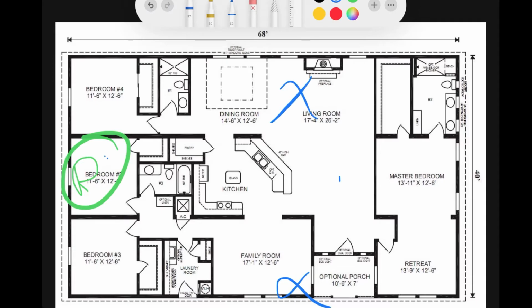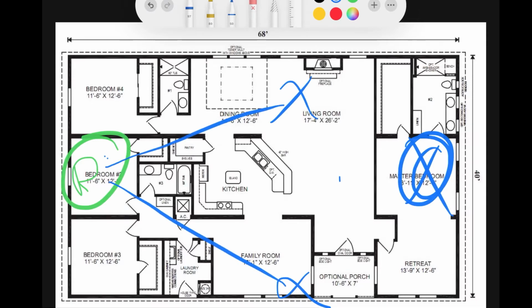Before I started messing with networking, I would always think, well, my Wi-Fi is really weak over here, why not just place it here? Well, it doesn't work that way. You want to get a signal from this guy as strong as possible. This right now is the most optimal distance. If you place it here, now you're in the yellow zone, so you're not really getting that optimal power because you're just picking up some leftovers. It's like the modem is trying to scream out, "Hey, can you hear me?" Yes, and you're going to get a sore throat and get tired. So that's what the gateway is doing.